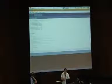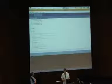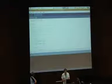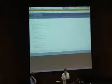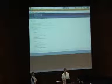All we're doing is setting up serial comms, specifying the outputs, and we're forcing the outputs low just as a bit of a setup thing to ensure that they start in a known state. And then we go into a loop. What we're doing here is looking for whether data is available on the serial port. So the Arduino itself is going to be sitting there watching the serial port, waiting for us to send things to it. And based on what we send, it will then do a different action.